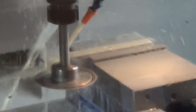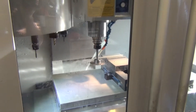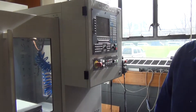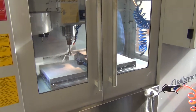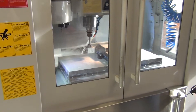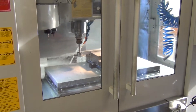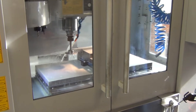So what things are actually moving in here? Because it's this diamond cutter — with a diamond slitting saw in there at the moment — so that's doing a 0.6mm cut, deep at 0.6mm wide, across the top of it. Because of the nature of the material, it's machining quite slowly. Normally it would be going faster, crunching through, but this is in its most delicate state at the moment.